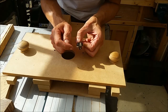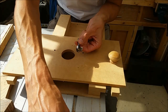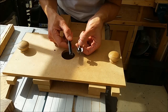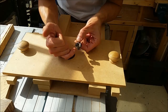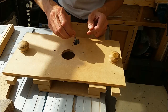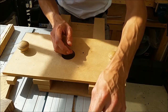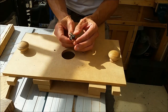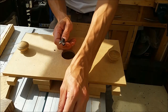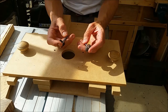The difference on this one is it's got a slight radius on the edge. If I compare that to your normal straight cutter, with this rounded edge you don't get that line on your piece when you're machining it. So this is what I'm going to be using. All of those cutters will do the job, but this is the one I've found to be the best. I'll put a link to both these cutters down in the description. One's a Trend cutter, the other one's a Wealden cutter.